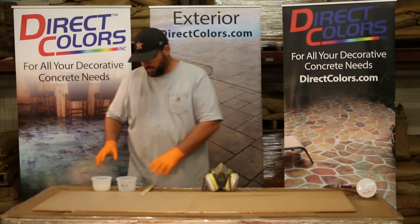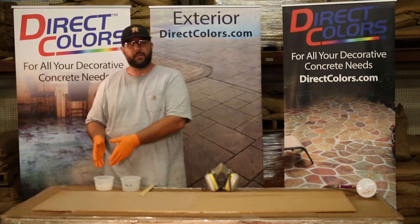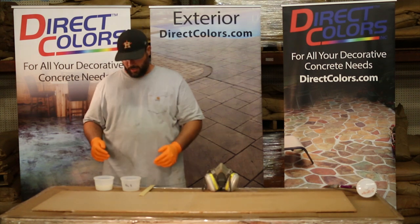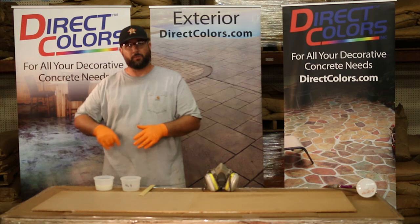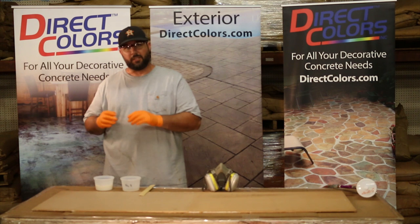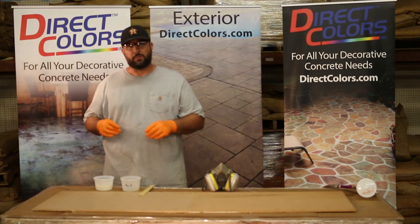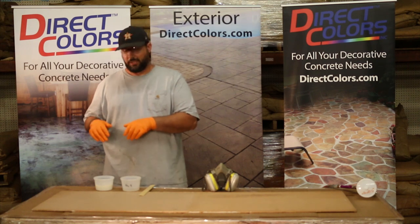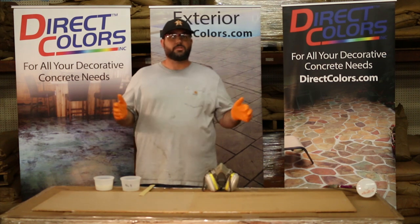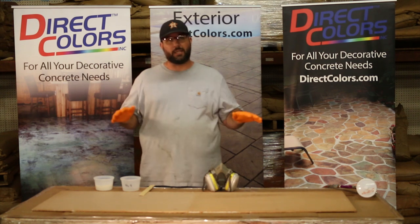We have our 550 polyurethane broken down right here. We've got the resin in can A — you're going to have a little more resin. Then we have a hardener in can B — it's a little less. We're going to mix these two together thoroughly. You want to make sure you don't shortcut that process because your sealer will not harden up evenly or completely if you don't get the hardener well stirred into this material.